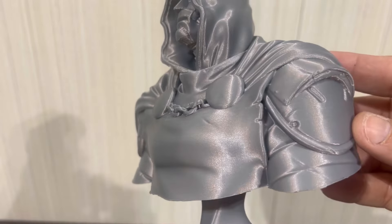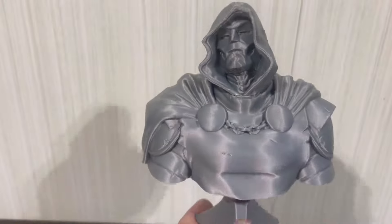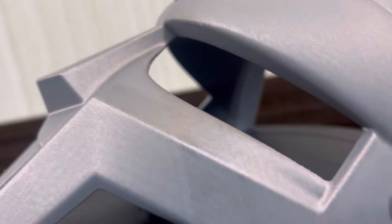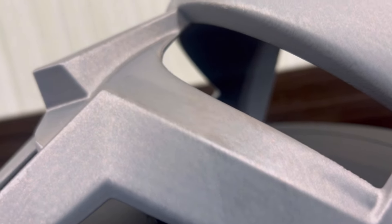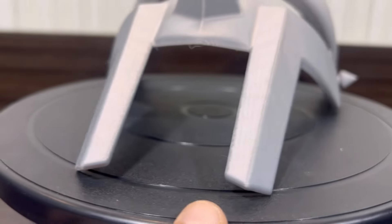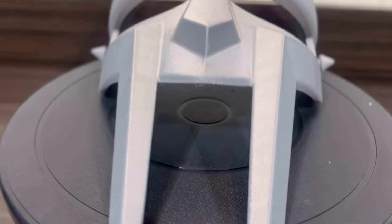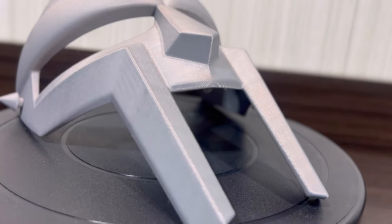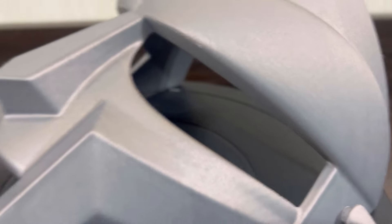Now that I'd seen what this metallic PLA is capable of, I wanted to push the limits. I printed an MF Doom mask at 500 millimeters per second at 215 degrees, based off another temp tower with the adjusted higher speed. The print itself came out very clean and defined — no zits, no major impurities for the most part. However, there was some zebra striping and color banding in random areas. So structurally the print came out great, but with silk you want that nice smooth shiny finish, so don't print at this high a speed — bump it down to around 350–400 millimeters per second. Even maxed out, structurally the print came out pretty good — so good I used the entire roll.